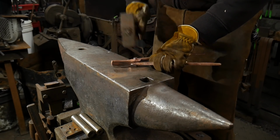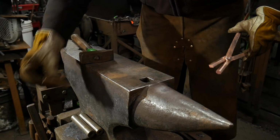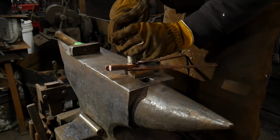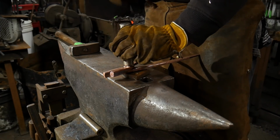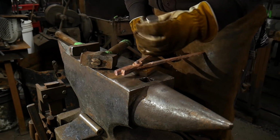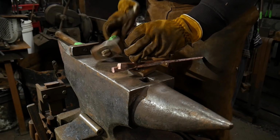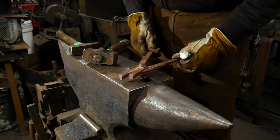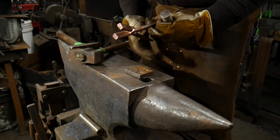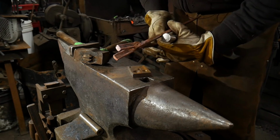We're going to upset it flat at first, and that's going to take it down to where it starts setting the tongs together. Then we're going to switch it over to using our rivet heading tools so we can drive a really nice round rivet home on this piece. So take your time with this. As copper is very soft, it goes pretty quick. Just make sure it's doing right. And we're going to have to adjust these tongs after this rivet's set. And we do a few more things to it, but we want to go ahead and get this rivet good and set down first.